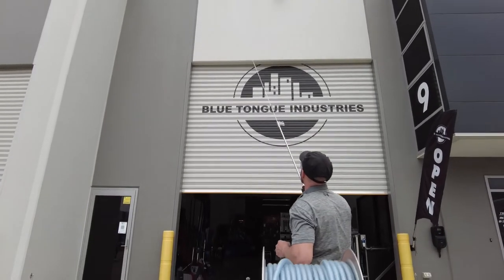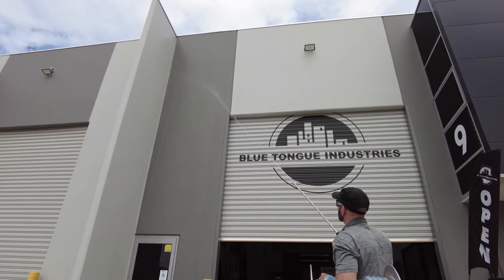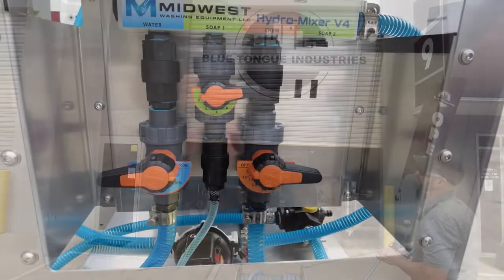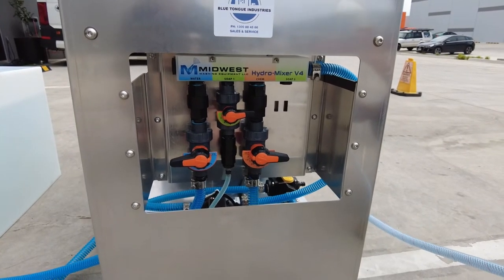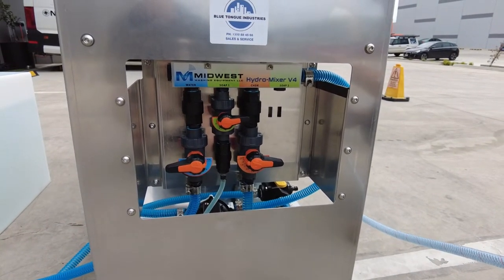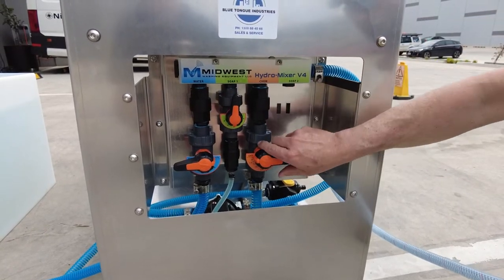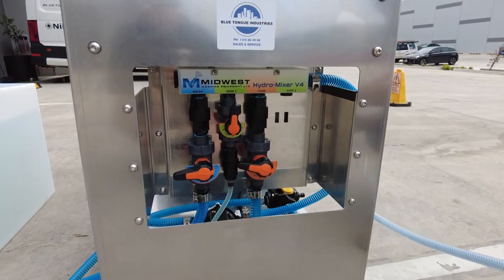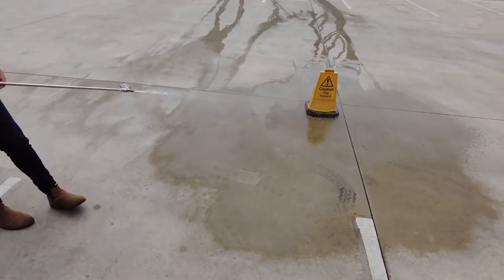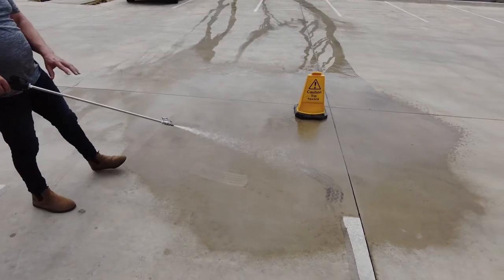You can see there's not much wind, and we're shooting 8.6 metres quite easily. If it was a double-storey house we're going to do that with ease. That is one of the larger tips, to limit overspray and get your SH up at that particular height. Powered by the Midwest proportioner, it's easy to set up depending on your application. You'll learn through experience how much soap surfactant is required — it works as a wetting agent to change the surface tension and allow the SH to stick. We can dial up what we need on the metering valve, and from an SH perspective we can go from 1% all the way to 6%, drawing more solution at the end of the tip.